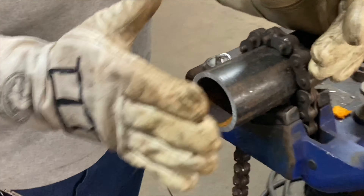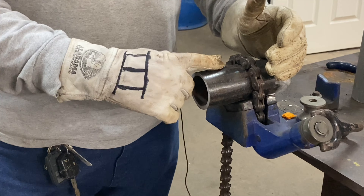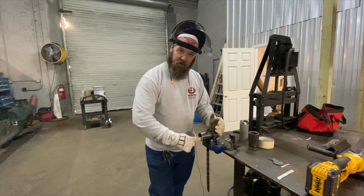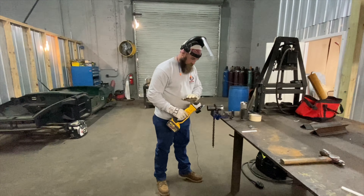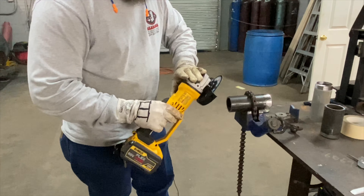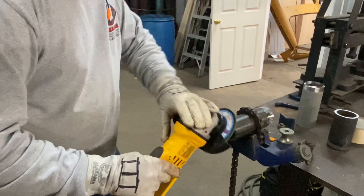You want to try to get a square cut — square meaning 90 degrees. On the outside of stock pipe when it comes from the mill, they have this stuff called mill scale, so you're going to want to get that off. On the inside of the pipe there's a coating they put on it to keep it from rusting. When I start grinding, I'm going to have my hand halfway on the handlebar and halfway behind it, so I can twist and turn and get my angle at 37 and a half degrees.